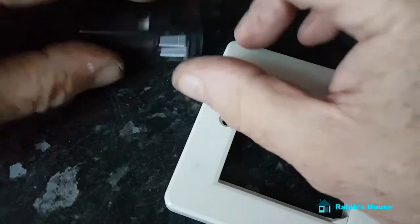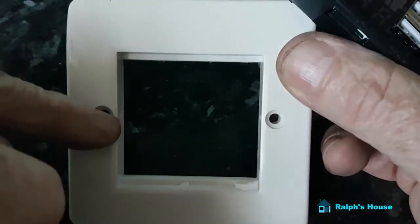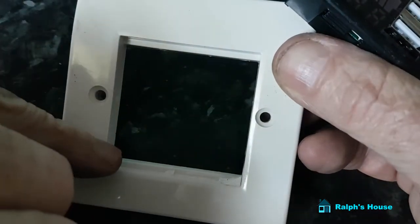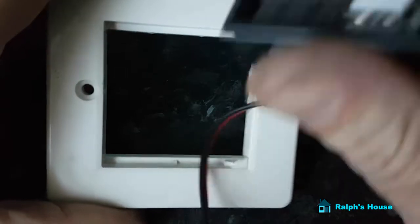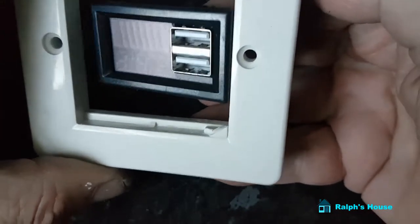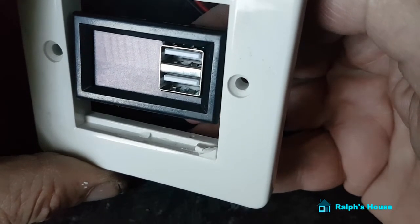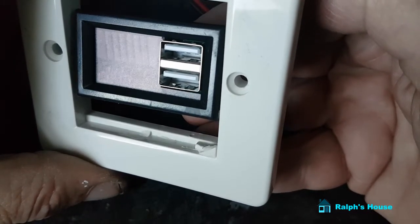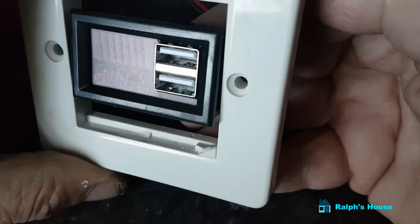What I could do is cut myself a plate from some quite sturdy plastic sheet — about six mil thick, it's pretty stiff stuff — cut a plate to go in there and mount that actually in the plate. That way you could use a domestic back box to house it. Lucky enough, this plastic sheet that I've got was my dad's, but it's green — I thought how apt, so you'd know it was 12 volt just at a glance because it's got a green backing to it.